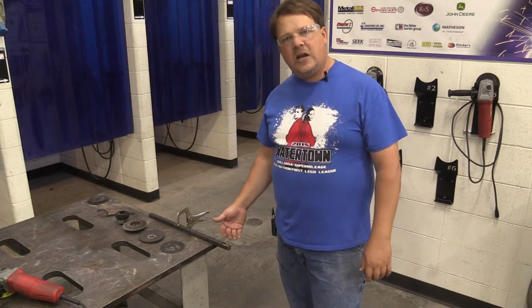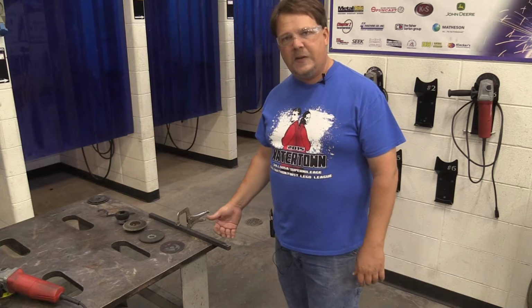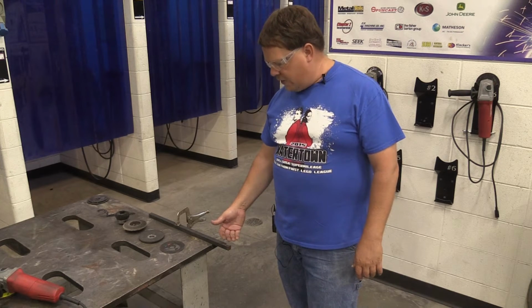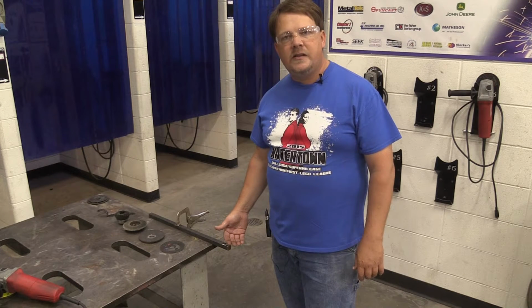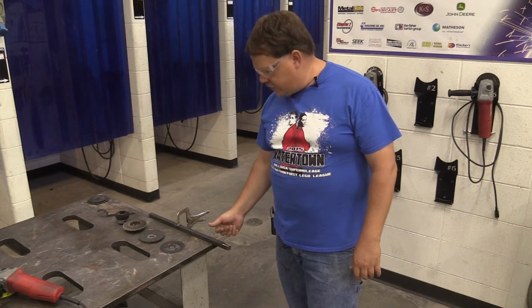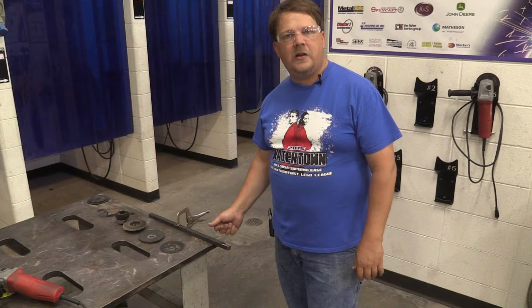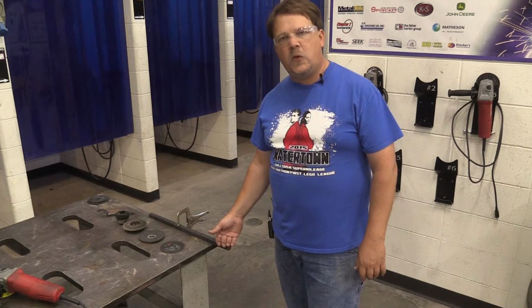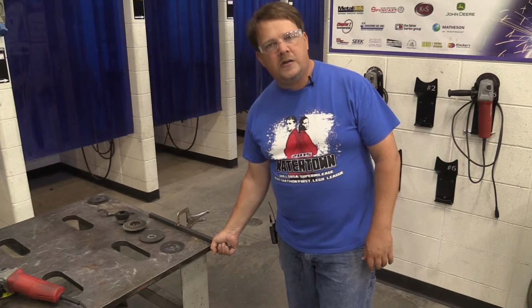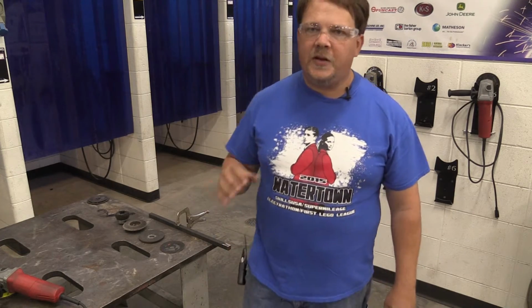But we always want to be careful when we're coming up to something that could be hot and how we're touching it. So I always like to get close with the back of my fingers to feel any heat. If I don't feel any heat, I'm going to just tap the back of my fingers. If I don't feel any heat there, I'm going to rest the back of my fingers before I go to grab that part. Because if I'm going to burn something, and don't get me wrong, we never want to do that. That's not why we take shop classes, to get hurt. But if we are going to burn something, we don't want to burn our fingertips.